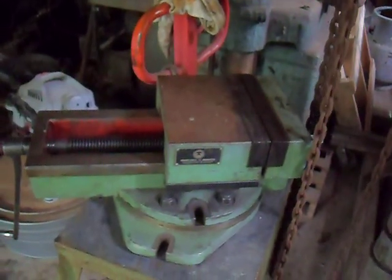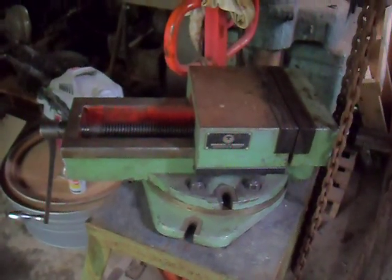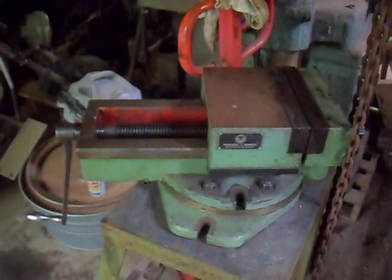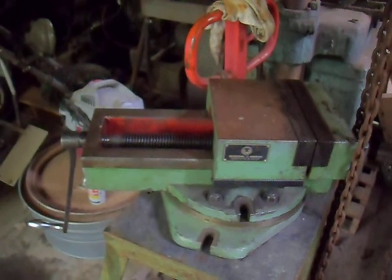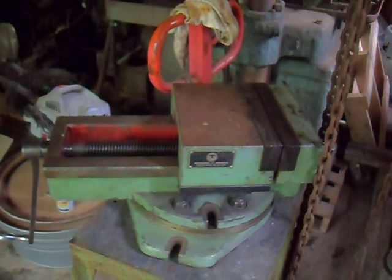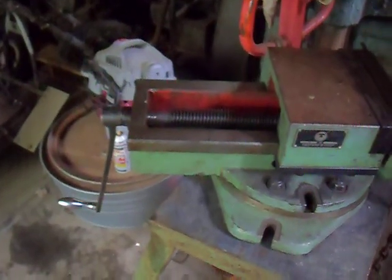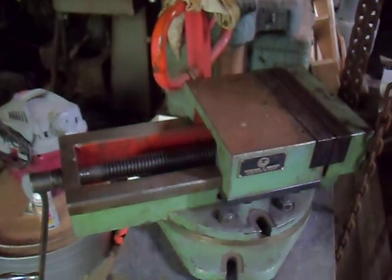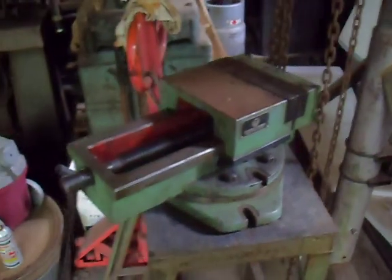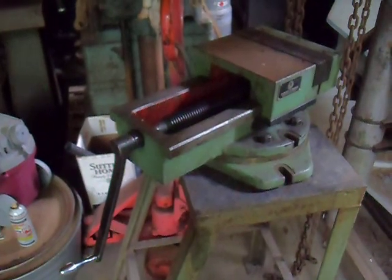It's got lockdown jaws. The jaws actually have pull down slide wedges, and it's a shaper style vise. The lead screw is attached in the back where the fixed jaw is, so it pull clamps as opposed to push clamps, like a milling vise. But anyways, 10-inch wide jaws. It opens to 11 inches. Really good condition. No pecker holes from being used on a drill press. Yeah, cool Russian milling machine vise. I could use this on the Giddings and Lewis horizontal boring mill or whatever.